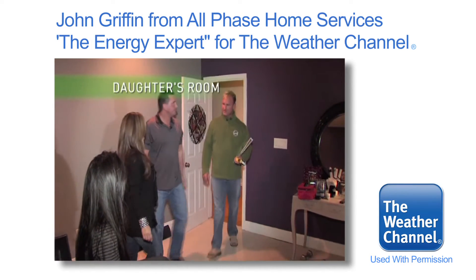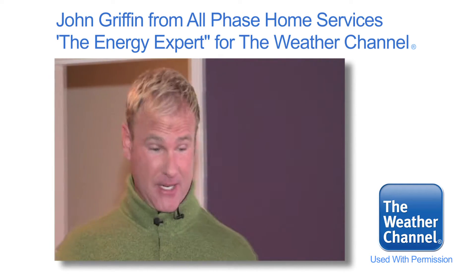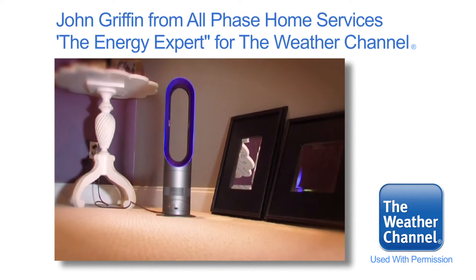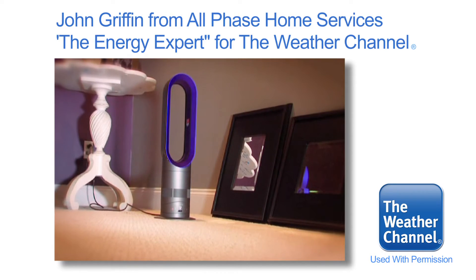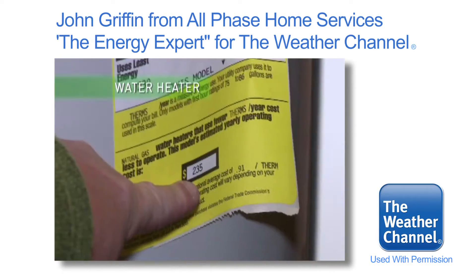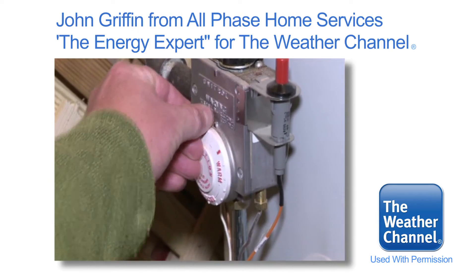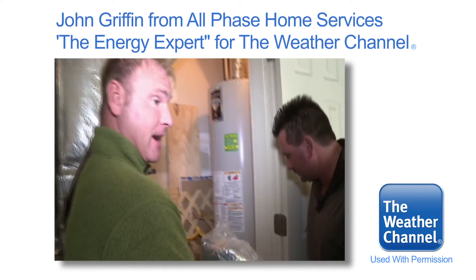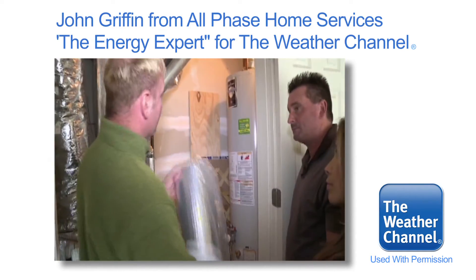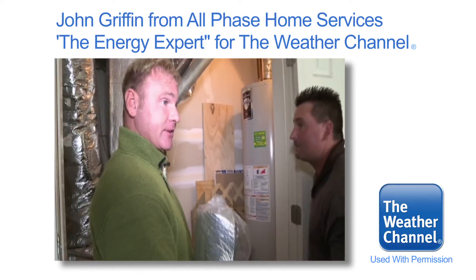This is my daughter's room, and since we're in the basement, this is the coldest room in the house. Rather than trying to heat this room with your HVAC, I'd get a small space heater and put it right here in the room — that will save you a bunch of energy. If you look at your hot water heater, it says it costs $235 a year to power. You've got it cranked up pretty hot. Wrap your hot water heater with an insulation wrap, and get all your exposed piping wrapped too. That'll help cut down your energy costs for gas.